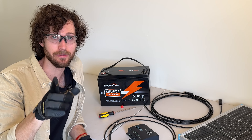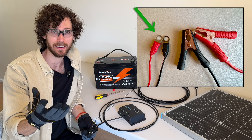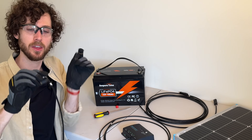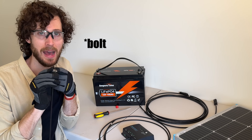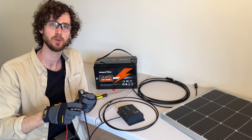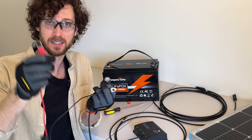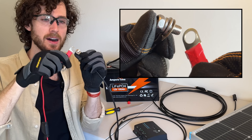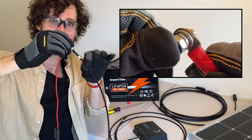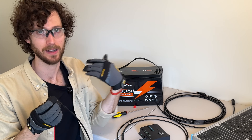But wait — are you using an inverter? If you are, inverters typically have two types of connectors: either ring connectors or alligator clips. If your inverter has ring connectors, then you're going to want to thread the positive inverter connector onto this battery at the same time. I just grabbed a small 150 watt inverter. These are also ring connectors, so save yourself time and hassle later on — thread the positive one onto the bolt as well. On this bolt I've threaded on the positive battery cable and the positive inverter wire. If your inverter has alligator clips, you do not need to do this — you can worry about it later.